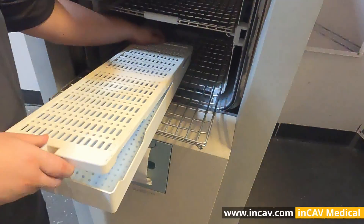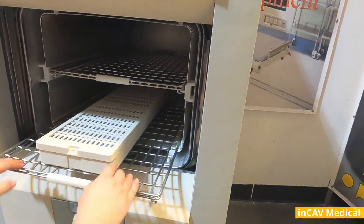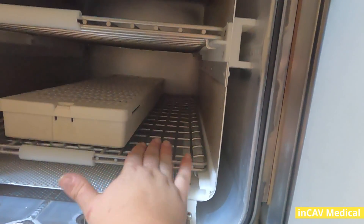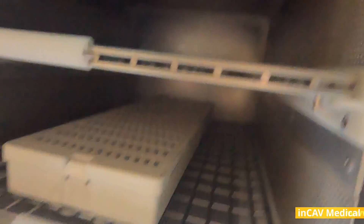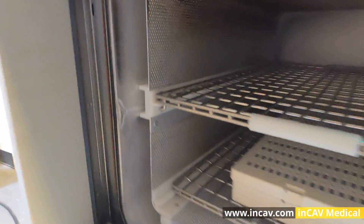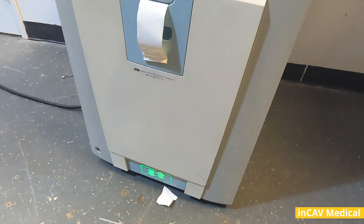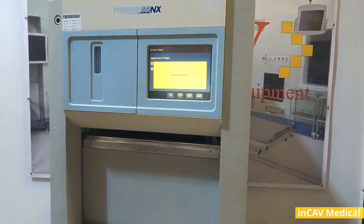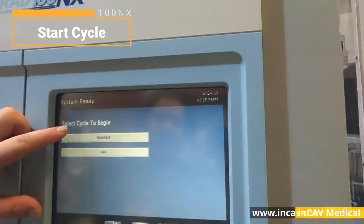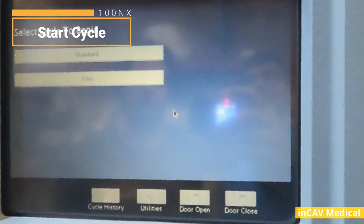You need to put the tray all the way back on the rack. Be sure that it is not touching the walls and all the time inside the racks. We push the rack inside and double check it's not obstructing the UV light from the top going to the sensor at the bottom, especially if we are using Tyvek bags that seem to touch the chamber walls. Now we can close the door and start the cycle — just click on Standard and Start Cycle. Now we wait 47 minutes.